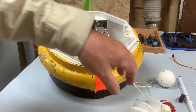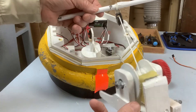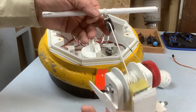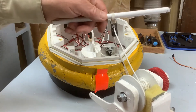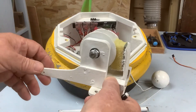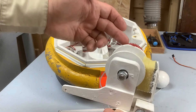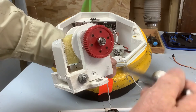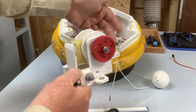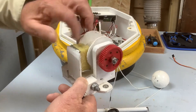This is the winch sub-assembly. The winch is driven from a servo — I'll put two of these together so there are no alignment problems. This holds about five to six meters of two millimeter polyester rope, which just runs through a small block and then goes down through the middle. The sub-assembly itself is bolted into the floor and sits on a pivot, and this gear on this side meshes with a gear on the servo to drive the winch. When we want to drop the anchor, the servo on the other side lifts this up, disconnecting it from the winch and letting it run free so the line spools out as the anchor drops.